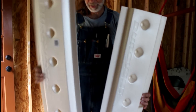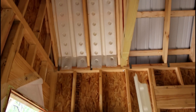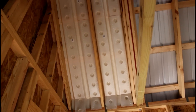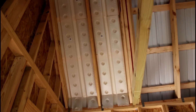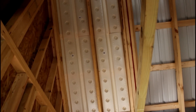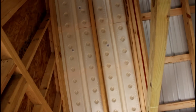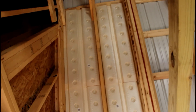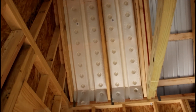I'm having to break them and put them apart because some of my rafters are not quite 24 inches apart - we're going to have beams in here and some are closer together, so I'm altering them a little bit to make them fit. This goes against the landing on the metal up there so that air can pass through from the metal, so that when we insulate it won't stop off our air vents and the roof will breathe properly.